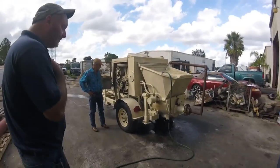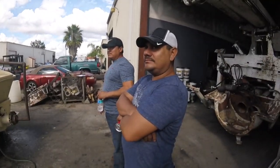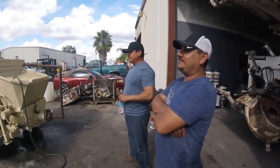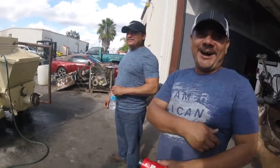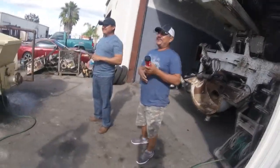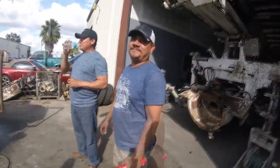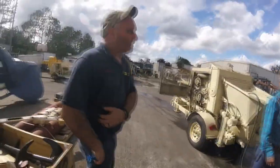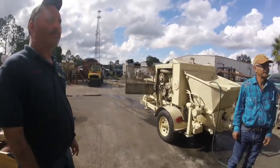So you're going to change your oil and your main filter at how many hours? Come on. Every how many hours? Cada cuántas horas cambiamos los filtros y los aceites. 250. Every 250. Yeah. Use a good oil, you know, synthetic blend, 10W30. It'll last, yeah, those engines last forever. They really will. But you've got to keep it on the oil.